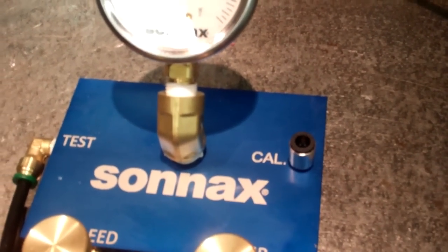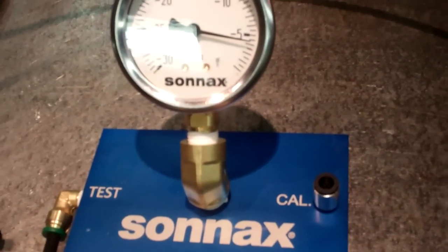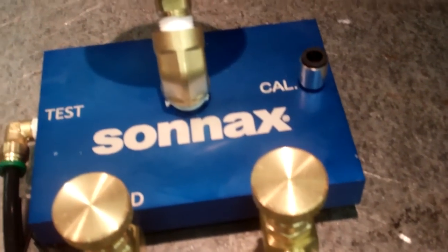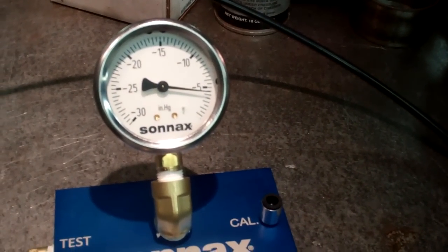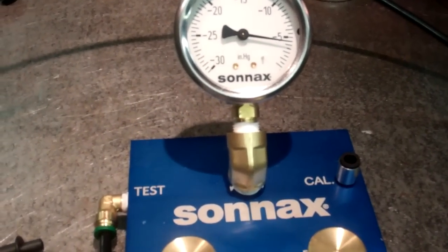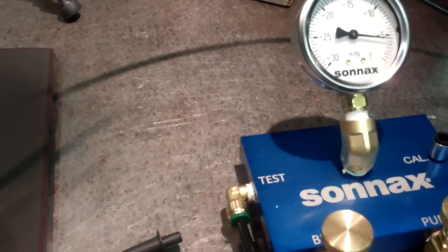It does appear to be critical. You could be 5 inches off, maybe more, depending on the weather and depending on your location of where you're doing the testing. If you're in the mountains versus lowlands, a lot of factors. So that's why I thought vacuum testing, I just used the vacuum pump to get readings on a valve, and that's completely bogus. Too much vacuum and you'll always get a decent vacuum reading, because it can overcome the leak.